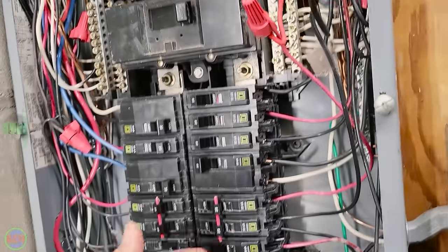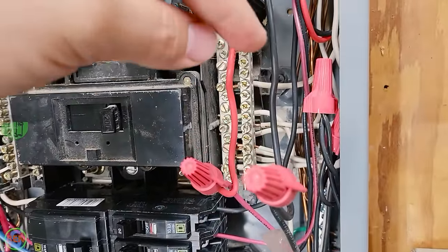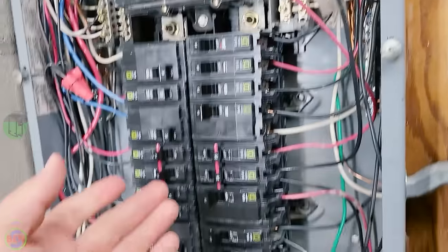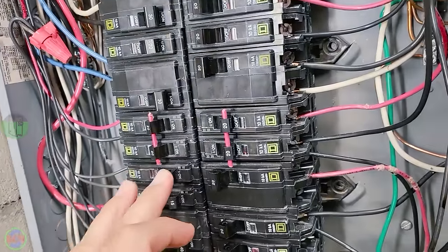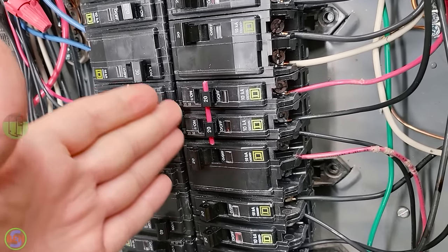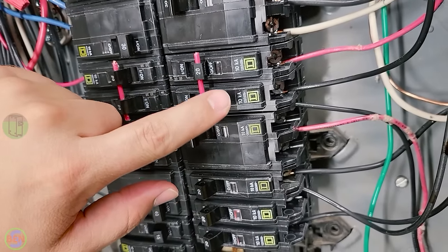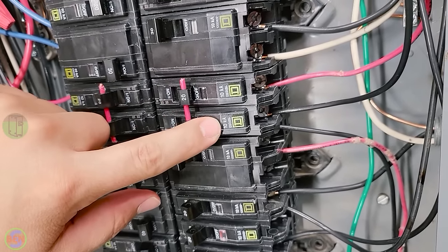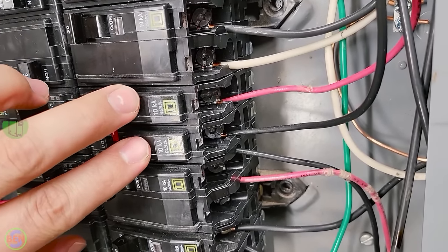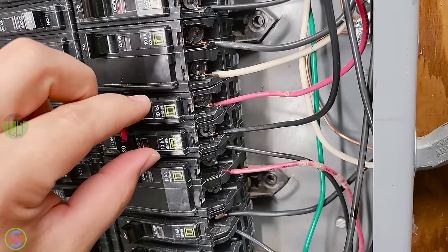And the bad thing about that is you'll have two times as much power going out as the neutral can technically carry coming back, because you'd have a single 12 gauge conductor coming back. Now you'd think that that would still be the same problem if you're not really familiar with the way the electrical works with a 240 volt panel. But the reason that it does work is that the power being used on this wire and this wire balance each other out. So if you had two toasters that were plugged into the two circuits that these are powering, and you were toasting toast at the exact same time, the current would actually balance out exactly.